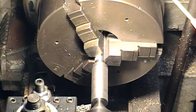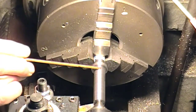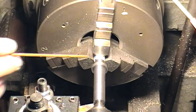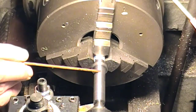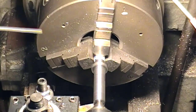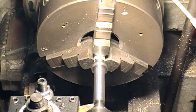That was 10 thou. We're going to work it a bit more and get down further. We've got down to — I think we're 11 shy of the half inch, which is for what we could call the boss area. Then we've got to bring this down to 3/8. What I tend to do is leave everything just a bit plus. For instance this collar here is too fat at the moment — I'm going to take off another 4 thou, which should leave me about 2 to 3 thou plus. Getting the basic contours down, then I'll change tools for a better finish and the final fit when I've dismantled the compound slide.